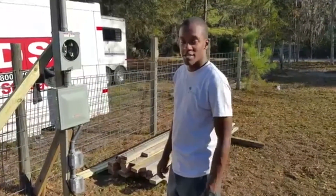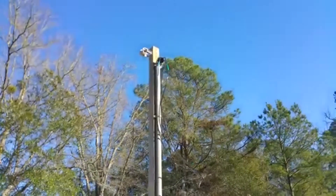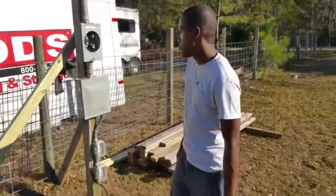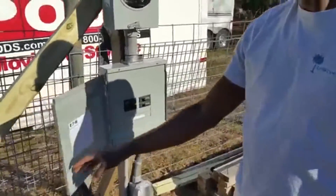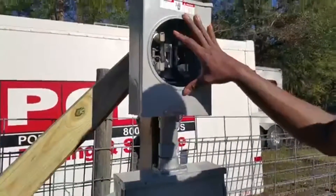This is a video on how to install a temporary power pole. We'll start at the top with our weather head — we have an inch and a half weather head with our number three wire coming out. Number three is rated for 100 amps. This is the breaker panel, which we put on a 60 amp breaker, but that will cover enough of what we need.